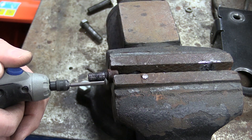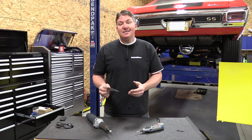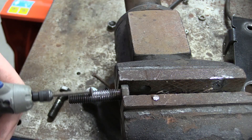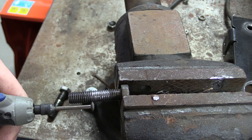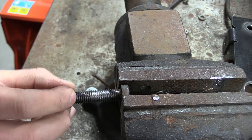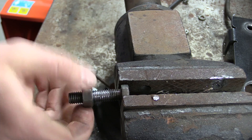If you're going to try to work inside something, I'd suggest you try to fix a couple bolts on the outside first — you'll find it much easier. This is great if you don't have a set of dies around and you just want to fix something quick and move on. It works excellent in the automotive field because you can take any bolt that you might not be able to reproduce or buy again, correct the threads no matter what they are, and use it again.